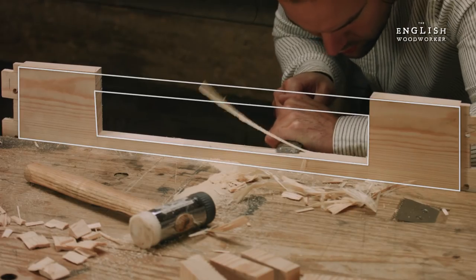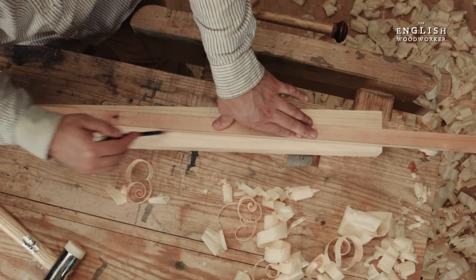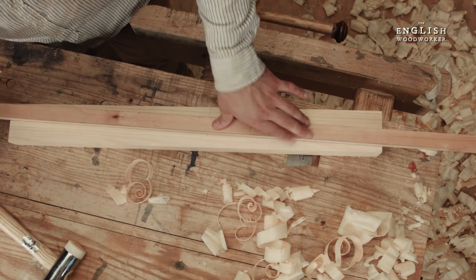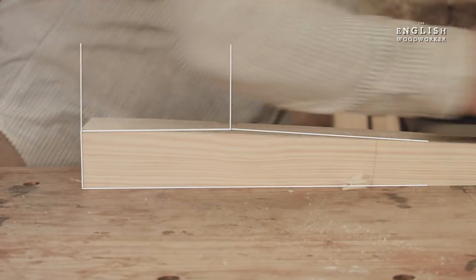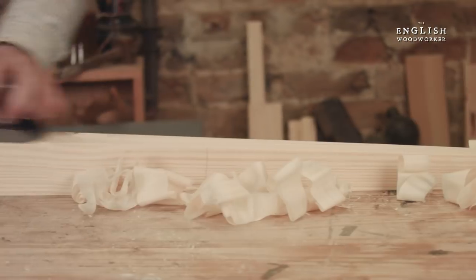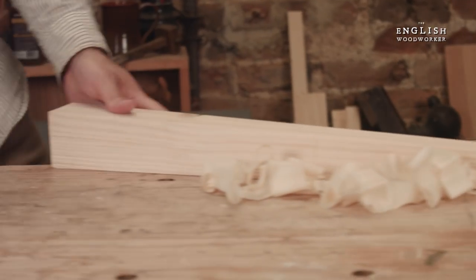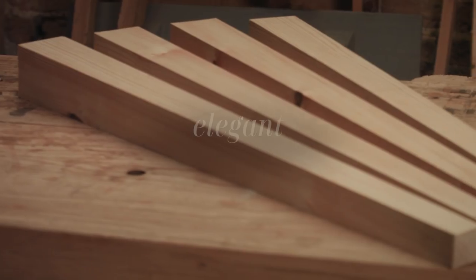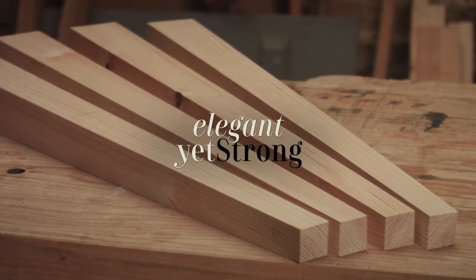This means that not only is the chop out easy, but we don't need to worry about upper drawer runners either. The second feature is the leg tapers. Normal tapers just stop shy of where the joinery happens, which keeps the joinery simple and square. These tapers go all the way to the top, which gives a usually chunky-looking, heavy design a little bit of elegance. And having it more elegant means that we can beef up the legs a bit, which gives it a stouter feel.